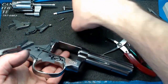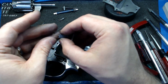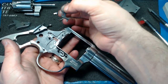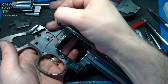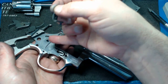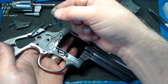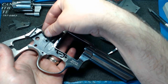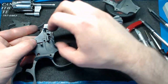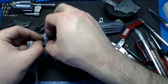That's pretty much it for how this revolver works. Reassembly is not too different from disassembly. I like to clean everything thoroughly and then put a very light coat of grease on it. There are places in guns where you use oil and places where you use grease. This is essentially a closed system — very little water or debris can leak in despite having openings around the hand, bolt, hammer, and trigger. It stays pretty dry, so you don't want oil moving around. A light coat of grease on all the inner working bits works well for revolvers. Whereas I use oil on almost everything in a semi-automatic, for revolver internals I go with grease.